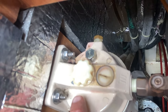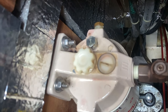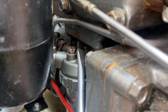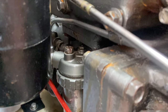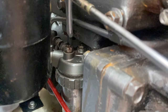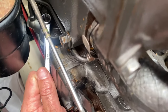This can get a little tricky as sometimes fuel will also leak out of the suction pump. I think I've removed all the air from the primary filter at this point, so I'm going to move on to the next step: bleeding the secondary filter. I'll close up this bleeder nut. Here's the top of the secondary filter housing — you can see two visible nuts, a larger one and a smaller one in the back. In theory the backmost bolt would be the bleed screw, but in practice I've found either one works, and this one is far more accessible. A 13mm short wrench works well to crack it open.